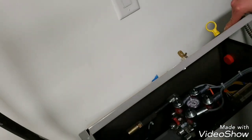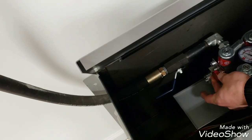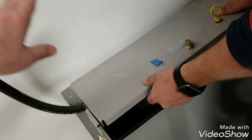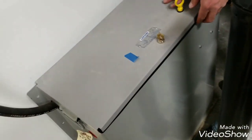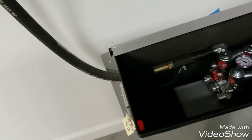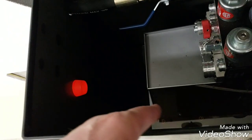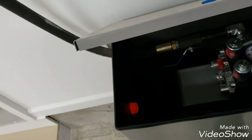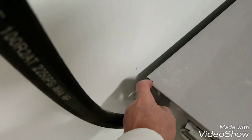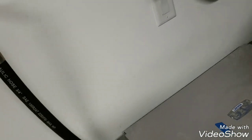Also in here — for some reason if that battery backup were to fail and somebody were to get stuck in between floors in the elevator — this right here is a manual lowering valve. If you just turn that counterclockwise, right now it's on so it's going to re-level back up, but that'll manually bleed the oil off and let the elevator come down. So when the elevator's on the first floor, most of the oil's in here. Correct. So if it's on the fourth floor, there's more oil in the system and therefore this level is lower. The oil will just barely be enough to cover that plate when it's on the top floor. The water should not get in there — it's sealed. It has rubber seals that run around. If water gets up that high, we got bigger issues.